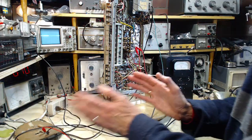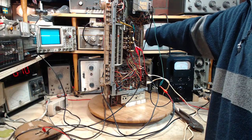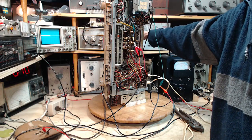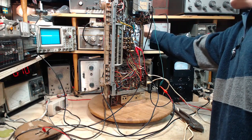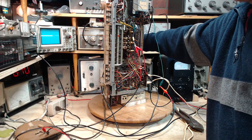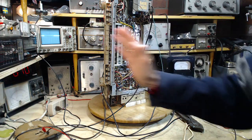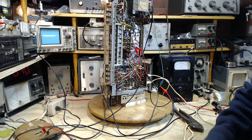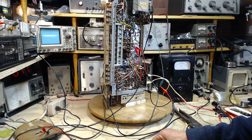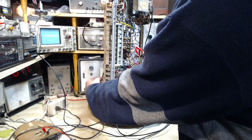Now that's the sound of the sweep generator zooming through the radio. I'll slow it down. You'll start hearing it. Oop, that didn't work well. Hear the thumping? I'll slow it down even more. Turn up its amplitude here. Okay, so that's the sweep, sweeping across the tuned point on this radio. And each time, it's just resulting in that knocking sound, if you like. But when it's going full tilt, it sounds like this. Which we don't really need to listen to.